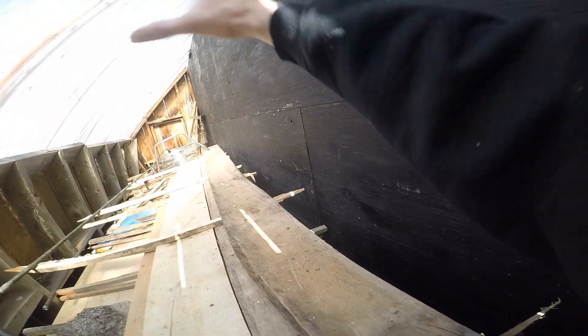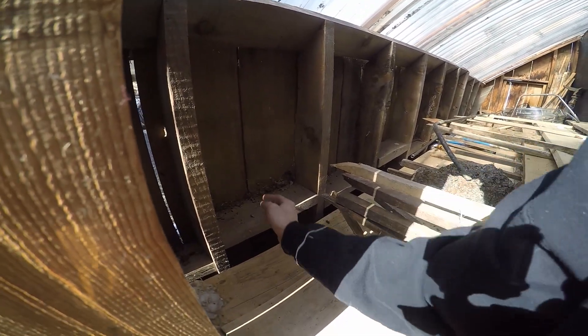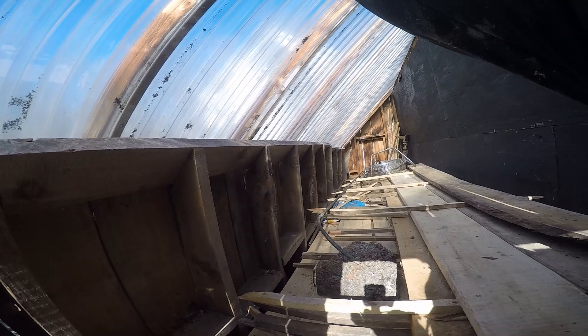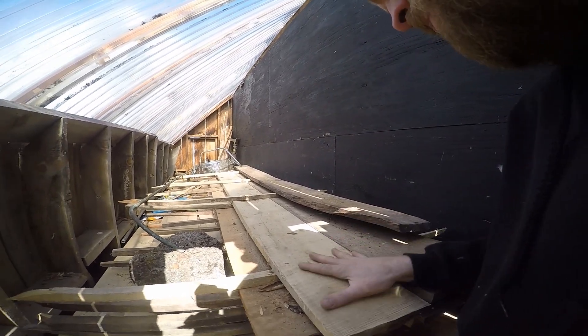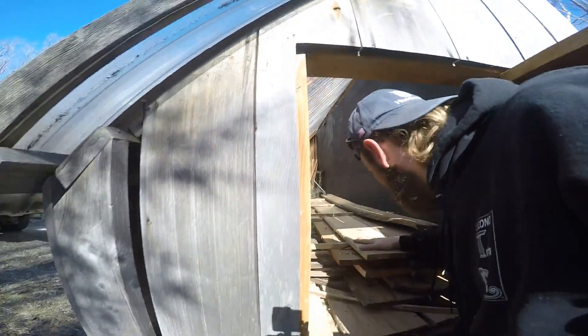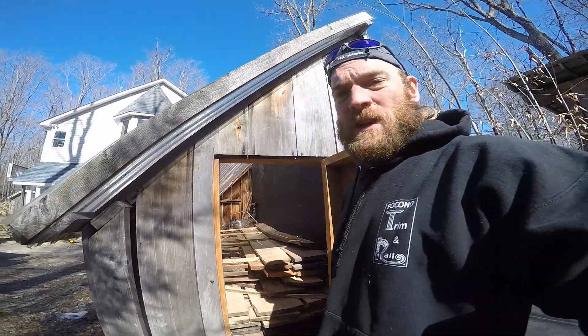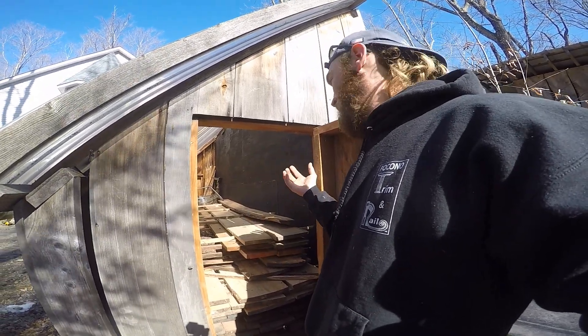That humidity is circulated around with fans. There's a fan down there, and there's a channel that can draw air in. The hot dry air comes through here, gets blown through the stack of wood, and comes out through here. A lot of it goes down underneath through the cracks and blows the high humidity out that way. Other air comes back around, gets dried out by the sun and heat again. Moisture may condensate along the roof, run down and drip out the bottom.